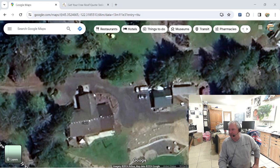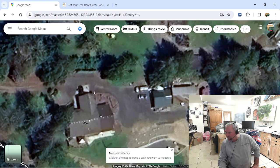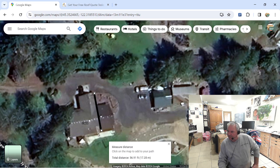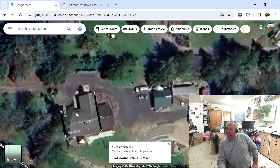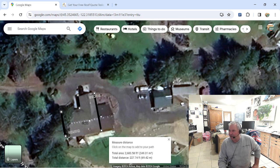You're going to find that corner of the house, come up here and click on about right there, then hit Measure Distance. You come down here and put a line down, because this is our line of where the new roof starts and the old one stops. Come over here to this corner of the house — there's a tree here so I think that's a shadow — probably about here, then the next one's probably there, then there. Basically I'm just doing all the corners, and then you come back to where you started. And that's going to give us a total area of 2,675 square feet.